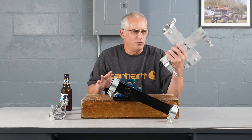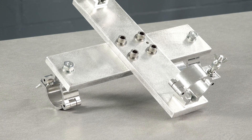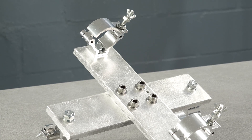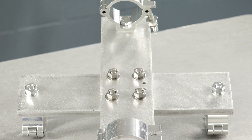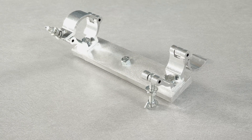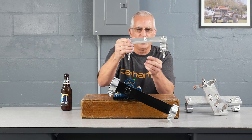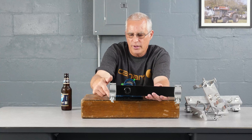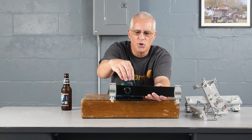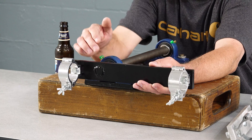So I built this in three primary pieces. One, this is a cross piece to hold the cross rail going across. It's two pieces of aluminum, three inch by half inch by about 12 inches long, drilled four holes in it and bolted them together at right angles. Drilled four holes in the ends and attached these truss clamps. This piece is to hold the camera — half inch by two inch, two holes drilled in for the truss clamps, and one hole in the center to hold the camera. I put a three-eighths inch bolt. This is half inch by two inch steel. I drilled a one inch hole in here and welded a one inch shaft to that hole. This is about 18 to 20 inches long. I used two pillow block bearings, one inch inside diameter, and two collars to hold it in place. The only welding I did was this piece right here.